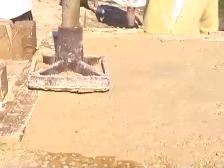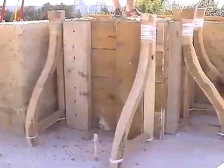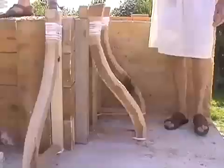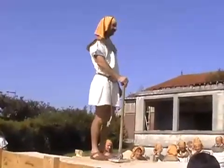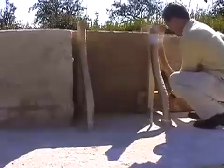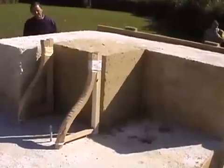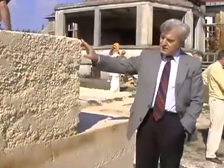When the climate is warm and beautiful, our crew rapidly produces a re-agglomerated limestone that proved strong, dense, and true to the mold's size and shape. The mold consists of small wooden boards which can be re-used many times for making other blocks. In this ideal weather, the whole process runs smoothly and is very simple. We remove the mold four hours later. The synthetic limestone looks like a natural stone — we observe no trace of wood grain. Four blocks have already been made.